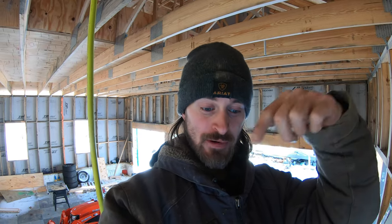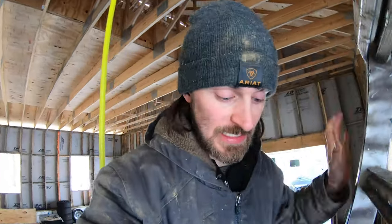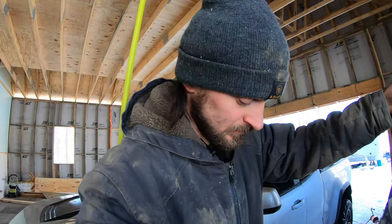The truss is gonna go down like this. Then we're gonna put some 2x4s and some soffits going straight parallel to the ground, connecting to the house. And that way air can get up under there, get in through tiny holes in the soffit, and then blow up and go all the way up into the roof. So we've got two things to basically still do for the garage before we can get ready for spray foam, but it's too cold to spray foam anyway. But that's two things that we have to do.